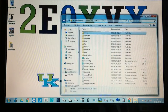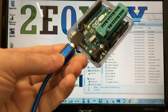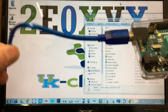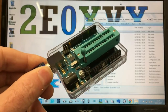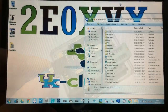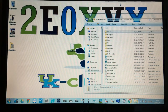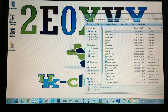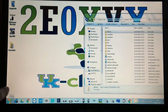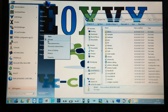The next step is to plug your Arduino into the USB lead and plug the other end into your computer. Once you've done that, you may get a message saying it's found the right drivers. If it doesn't find the drivers, go to the Start menu at the bottom, right-click on My Computer, and go to Manager.